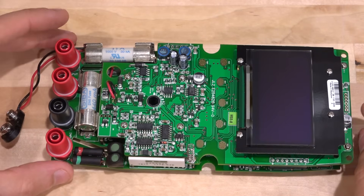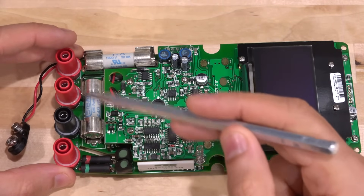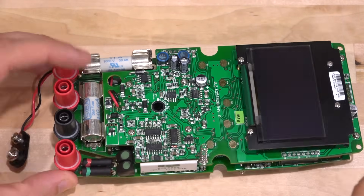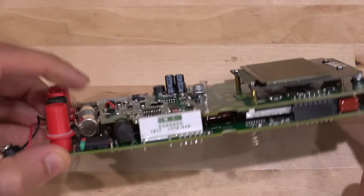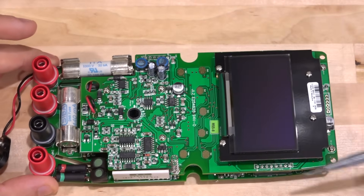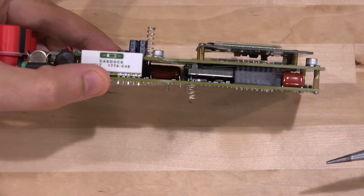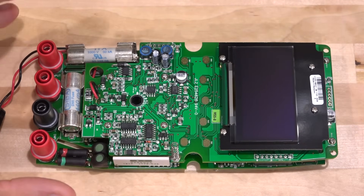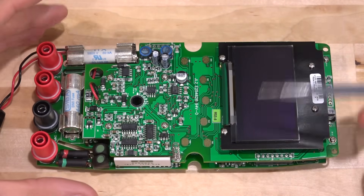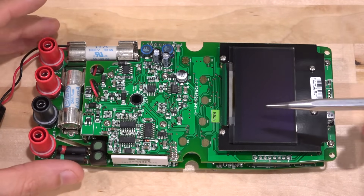Here's the internal of the multimeter — it all comes out in one piece. As you'd expect it has very good input protection, nice connections to the PCB from the terminals, and cutouts and clearances in the right areas. I'm mostly interested in looking at the OLED. This is a module and should be easily removable. If you remove the screws you can just unplug it. I'll show you the replacement and the strategy they've used to make a drop-in replacement with a different OLED model number.